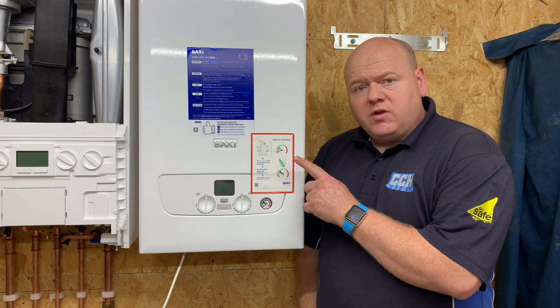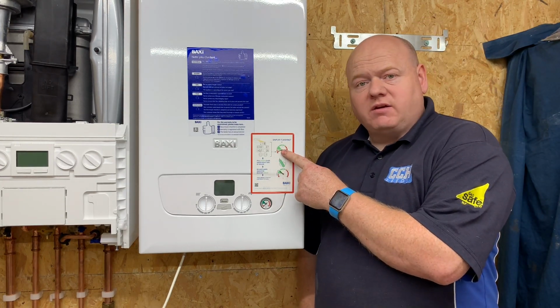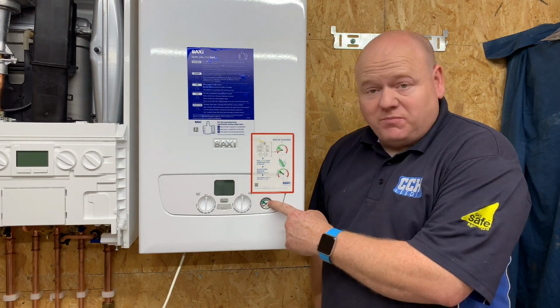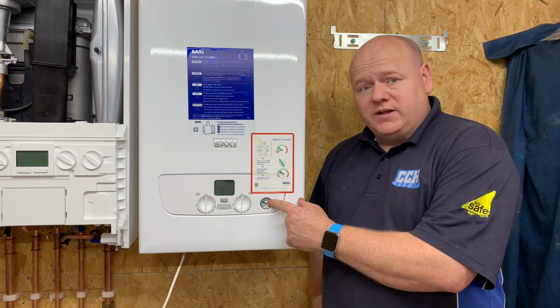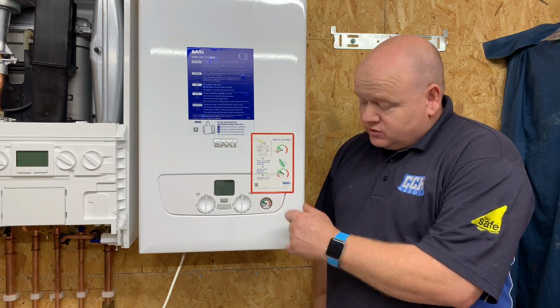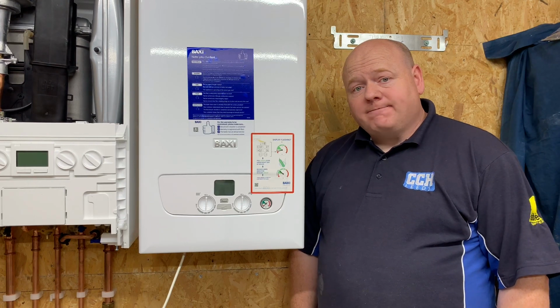There's a label that comes with the boiler, and the label tells you to take it into the green. Now the green goes a long way around, it goes all the way around to past 2, and you do not want to be pressurising it all the way up into that green, to the very top of the green. So yeah, top it up to about 1 bar if you can, and thanks for watching.